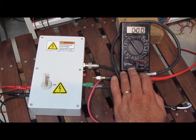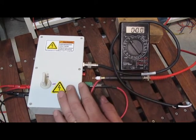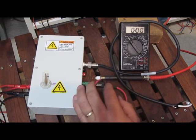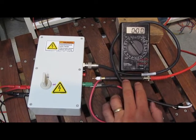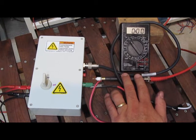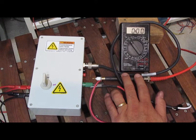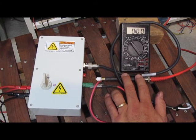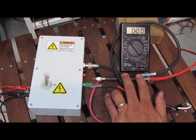We've already talked in the first video about the transients and this generator. I'm putting out lower power than what the meters would actually normally be tested to — I'm just trying to weed out any meters that may not even come close to meeting their rated specifications. My plan is to test them for CAT 2 standards, not CAT 3. The specification states the test voltage is applied between each pair of terminals used to measure mains where voltage limiting devices are present. Note: this test can be extremely hazardous. Explosion shields and other provisions can be used to protect personnel. No hazard shall arise due to the operation of the overvoltage limiting component — the component shall not rupture and shall operate as intended during the test.